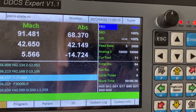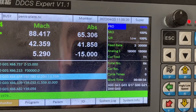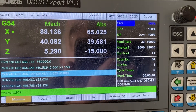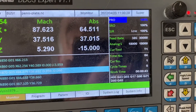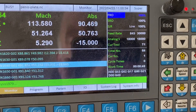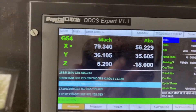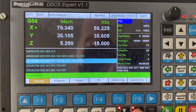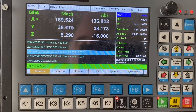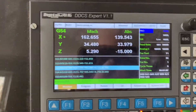Stop the MPG and the feed rate stops. Just watching the counts of the MPG and stepping through the code to get into your next position — the faster I go, the faster it will snap through the code. Let go of the MPG, press the try cut button off, and the code will just resume into automatic.